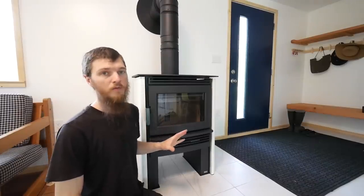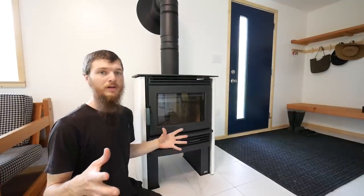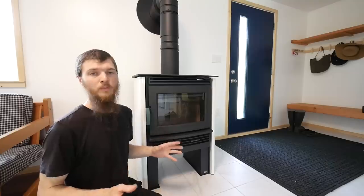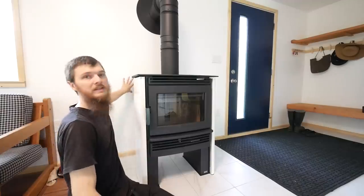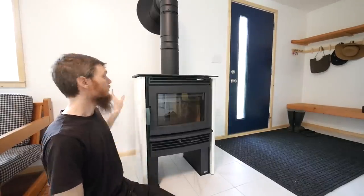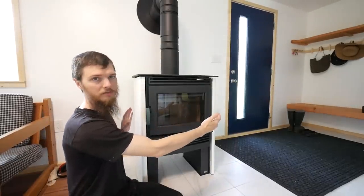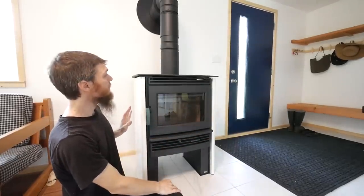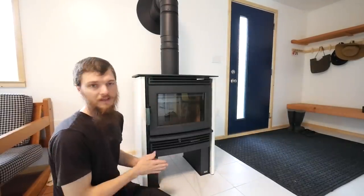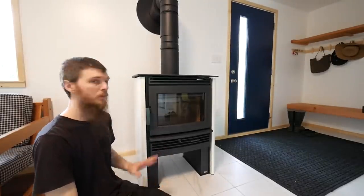I didn't want to over-explain, but I really wanted to point it out because a lot of older, more conventional wood stoves require a lot of space. A lot of people might be concerned we didn't put anything on the back wall or floor. This wood stove is designed for 8-inch clearances all around for a mobile home installation. In the USA, the non-combustible pad under the floor extends 16 inches from the front of the stove, and this does that — so it's totally safe.